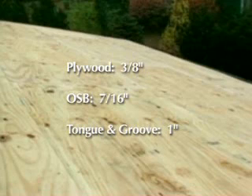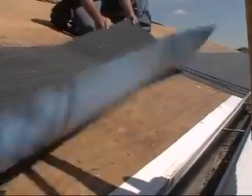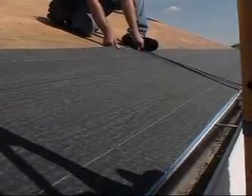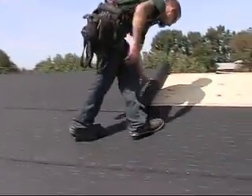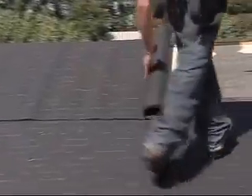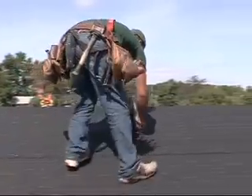All wood decks should comply with APA-engineered wood association specifications. Use CertainTeed WinterGuard waterproofing underlayment, or equivalent, as recommended. A minimum of No. 15 organic felt underlayment, meaning ASTM D226 Type 1, should be used to cover the roof deck areas not covered by waterproof underlayment.